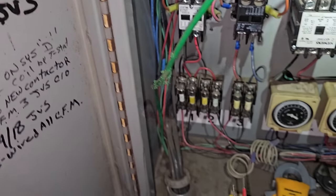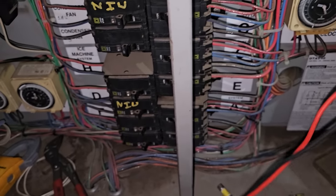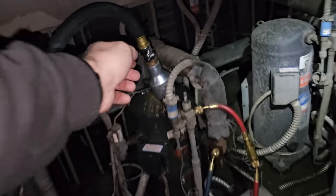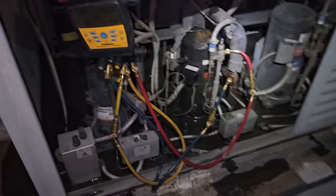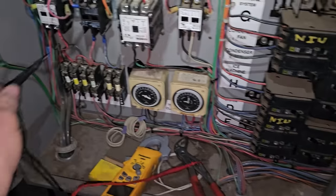I changed the fuse — here's the bad one. Looks like our compressor reset. All three have resistance now. So we need to go ahead and turn off the water tool — we've cooled it off. Usually let it run for a few minutes after it's cooled, just to be safe. I'm going to let the water calm down so we don't short anything out, then we're going to try to restart this guy. Condenser fan motor is back on — condenser fan motor runs.